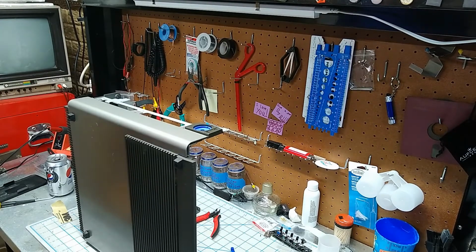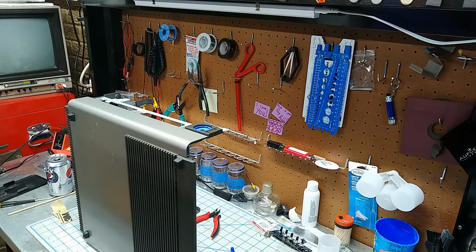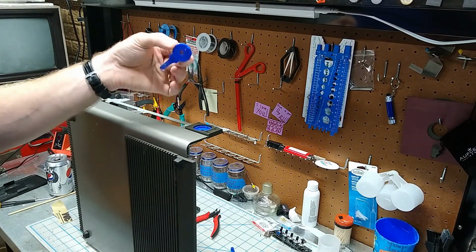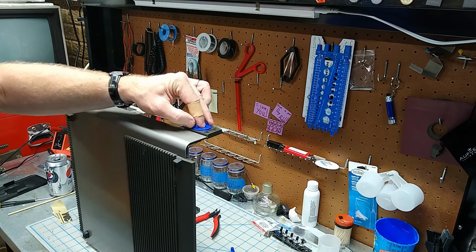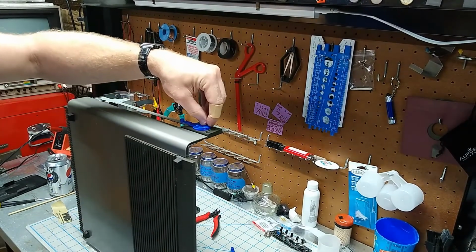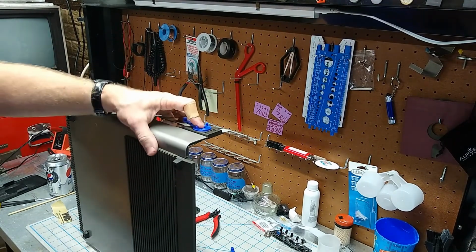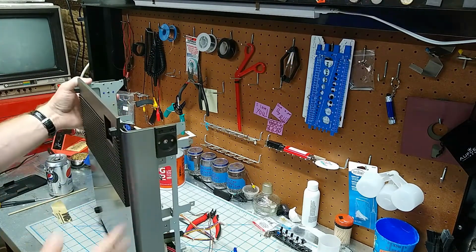You may have to trim the printed parts a little bit. Like mine, I think, was over extruding a bit, so I had to trim the pegs a little. But that's what we want. And then you're going to take this piece, making sure that the springs don't pop out. We're just going to put it in like this, making sure that this part goes in the slot. Okay. And then tip it up. Do the same on the other side.